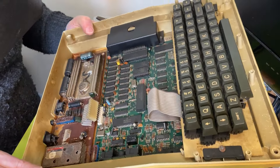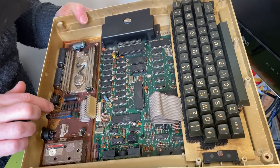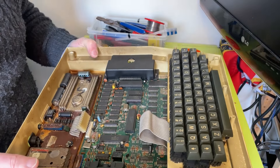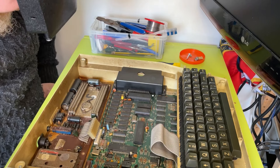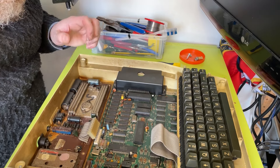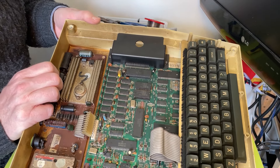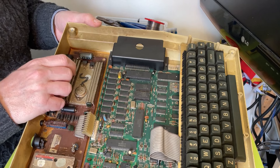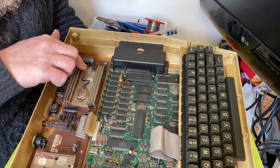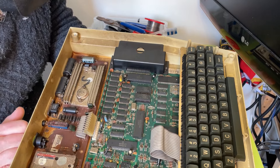Yeah, that's a real problem — I'm going to have to drill it out. That seems very draconian but I can't think of any other way of doing it. Also, those diodes don't look in a particularly good state — that one's actually got some corrosion. If it's been sat in water and somewhere damp then all this stuff is going to happen to it. That is also missing a bolt. I think that's been replaced at some point and not replaced very well — somebody's probably replaced that but the leads aren't long enough so they just left it off. A little bit nasty and horrible.